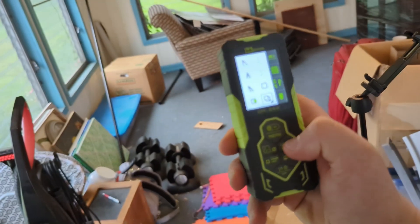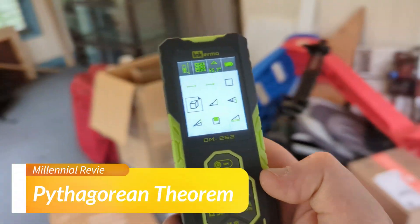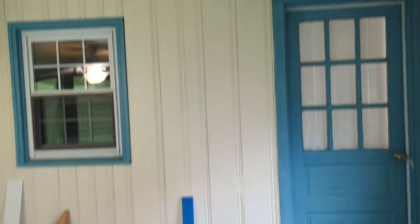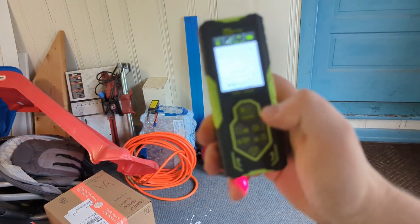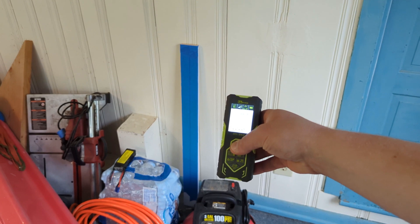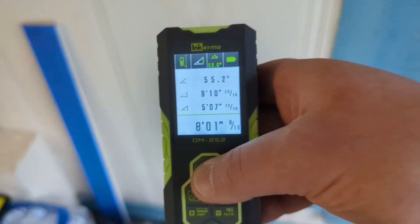Last thing I want to show here: let's use this device to find the height of a wall. I'm going to rotate it again so we can look at it vertically. The ceiling is in fact sloped, so it's going to be two different measurements. We can move over, grab our first angle — what I can do is just get the measurement up on the ceiling, it's going to take the other one to the ground, and it's using the angle of this device to know what it comes out to. Hit enter and we've got a ceiling height of 8 foot 1 inch and 9 sixteenths.